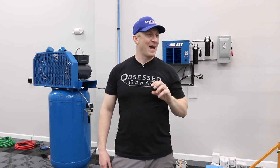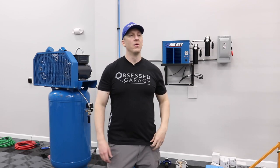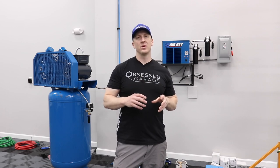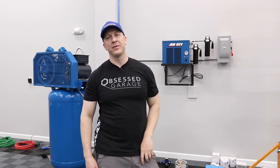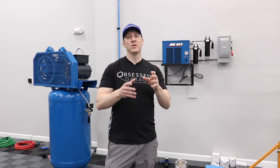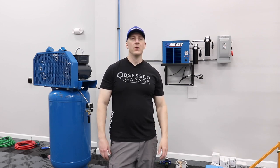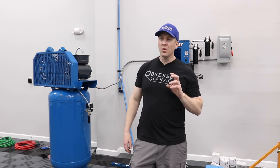The biggest project right now is to get the unistrut set up. So I'm going to share with you how to mount hose reels to either the ceiling or the wall using unistrut and spring nuts so that you can hit studs and hopefully make it look clean. On the ceiling, I'm not really worried about the unistrut, but if I was going to do it on the wall and wanted to mount these hose reels sturdily, I'd probably end up painting the unistrut. So anyway, I'm going to work on that today.